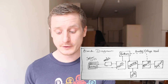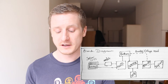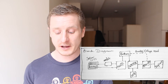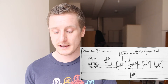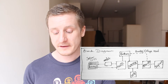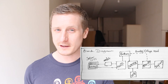You'll see on the left there are solar cells. They're connected via a MOSFET in reverse bias, so it's acting as a diode but not dropping as much voltage. It's connected to the MAX 1811, which is the charger for the battery. The battery is also connected to the L6920dB, which is then broken out to the USB. That connects to the ATtiny85 and to the display. The ATtiny85 has a dotted line reading from the battery before it goes into the L6920dB - so that's basically what I'm trying to achieve.